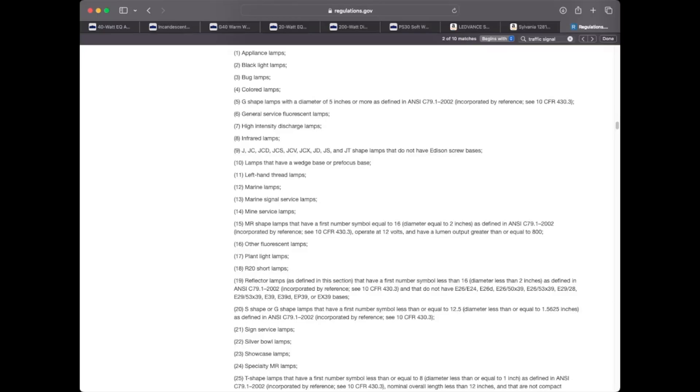You can also get some higher wattage bulbs depending on what you are doing. With a 60 or 100 watt bulb on a hi-fi receiver you can use that to initially power it on after repair to make sure there are no issues. But if you want to turn the volume up a little bit you will find that the bulb is going to light up, so you might want to put a 200 or 300 watt bulb in there until you are confident that the thing is stable. I keep a 200 and 300 watt bulb in my drawer. In the theme of this video I was only going to talk about things that you can go to Lowe's or Home Depot and buy today without special ordering.